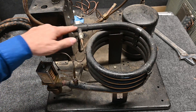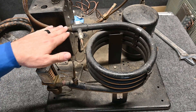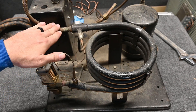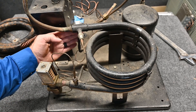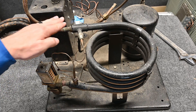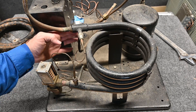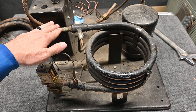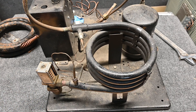Even though the water has heated up, the refrigerant coming in at this end is at its hottest point. So as the counterflow works out, the water's coming out at its warmest point here, but the refrigerant's also coming in at its warmest point. So the refrigerant is still going to be warmer than the warm water. There's going to be second law of thermodynamics heat transfer — heat's going to leave the refrigerant and go to the cooler water. They're not always set up that way, but typically that's how they are.